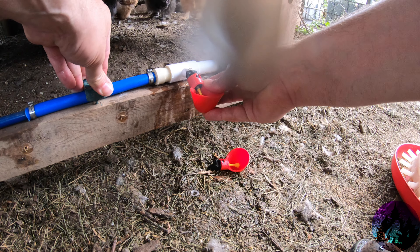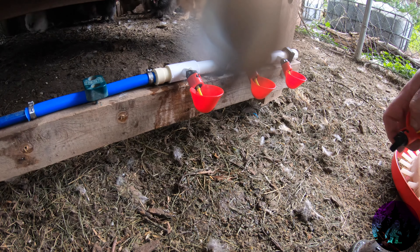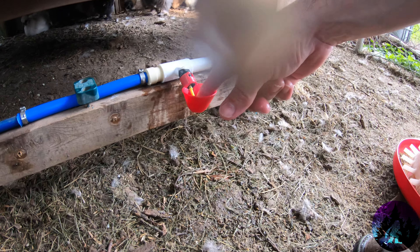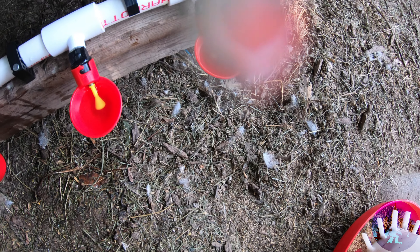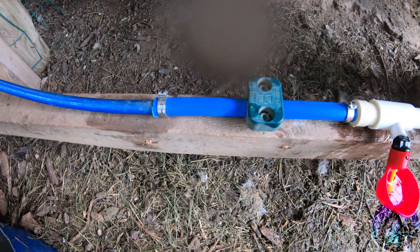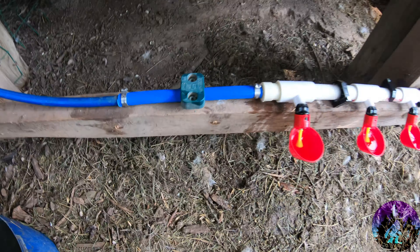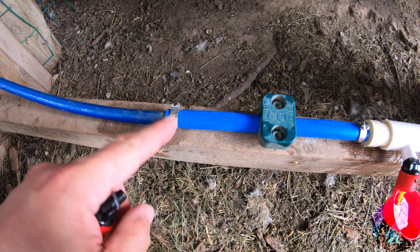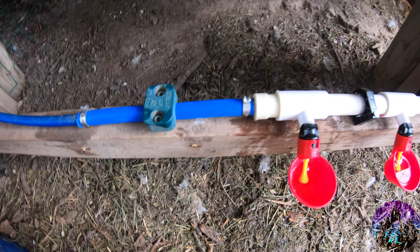Just like that. Let's get these out of the way — now we've got no leaks. And then they come up and go, oh, what's this? They hit them and it fills up with water, just like that. So they just hit that and it fills up with water. As you can see, I had a different size of hose — what I did there is I took a step bit, drilled into the PEX so that that would go in, and then just clamped it. And as you see, no leaks — so we're good.